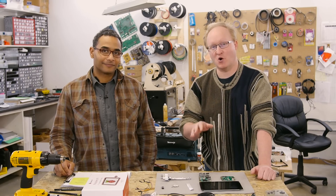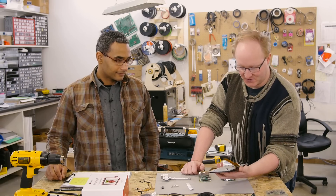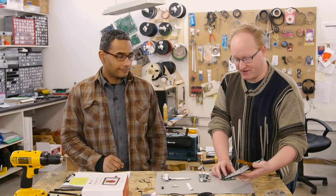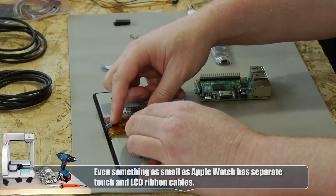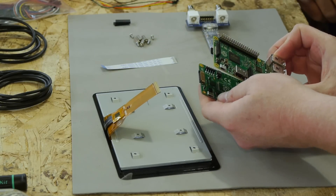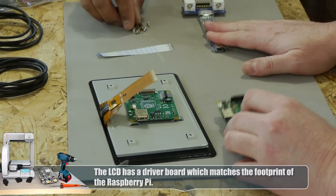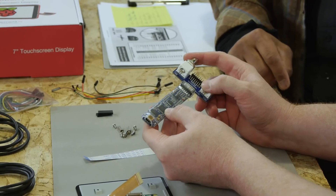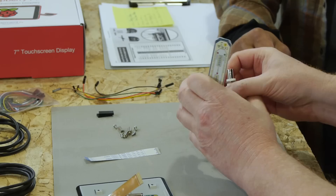Here are the parts we need to assemble a desktop Bitscope oscilloscope using the Raspberry Pi 2. We have the new 7-inch screen for Raspberry Pi — it's got a touchscreen on it, a new product from Element 14. There's a touchscreen controller and the video data here. Most of the time with these screens, even on a small cell phone, there'll be different cables for the touchscreen controller and the video itself. There's a nice mounting plate for both this and the Raspberry Pi — this footprint matches the Raspberry Pi. And now this is the Bitscope itself. It consists of an FTDI USB converter chip, a microchip microcontroller, and a few other integrated circuits — I would assume one of them is probably an op amp of some kind. There are trim pots which are apparently locked in place, and then this is the probe connector on the end.